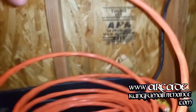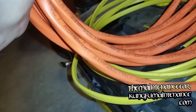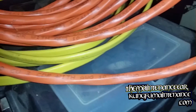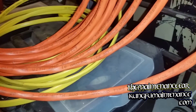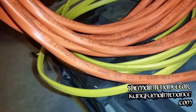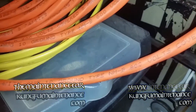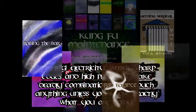Similarly, this is the 10-3. It reads: 10 AWG CU 3-conductor with AWG 10 ground, type NMB. The NM stands for non-metallic sheath cable, and the B indicates the temperature range it can withstand — up to 194 degrees Fahrenheit. That is the temperature the wire can handle before the sheathing or insulation starts breaking down.